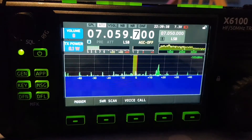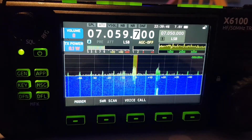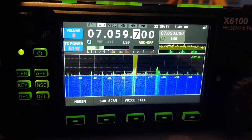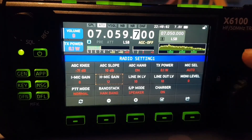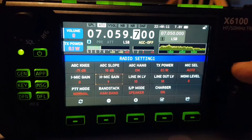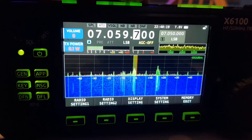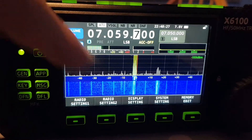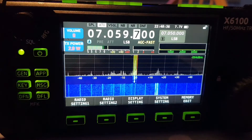Let's exit that. I'm just grabbing the microphone. So we'll go to general, like so — radio settings, mic gain, which I'd turned down. Put it back up to 10, I think that's where it was. Hand mic gain. Might as well put the internal one back up to 10 as well. Exit that, get the microphone in there. Let's whistle — now look, this isn't moving. Turn the AGC back on — nothing happens.